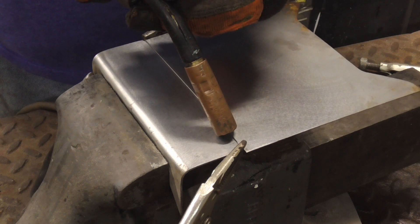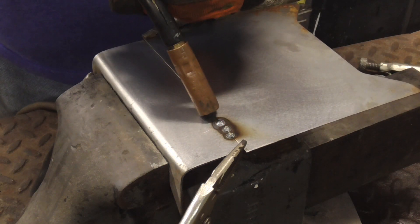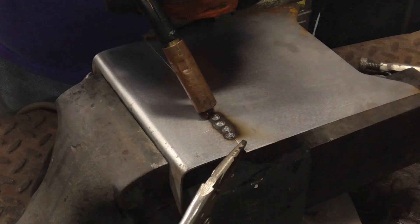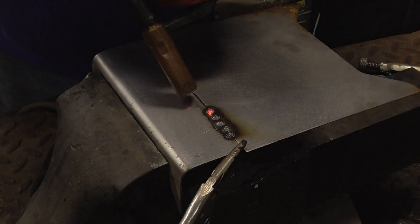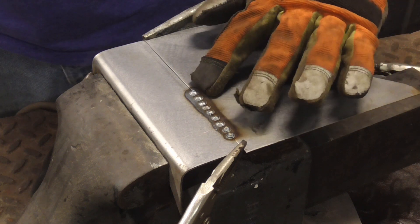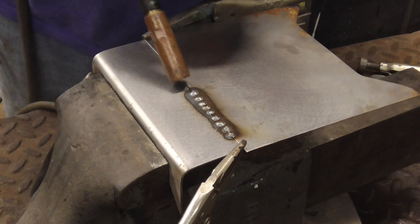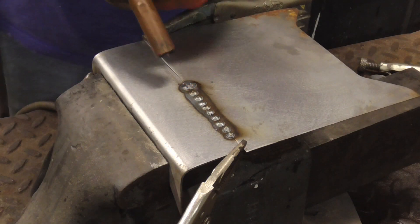I'm going to stick it right there and just pull the trigger for about one second. I keep using that as a guide. Now those are just spot welds. If you want to change it to sort of a stitch weld, you can start out here and twist the handle — start out here, roll it a little bit, and it sort of turns into a stitch weld.